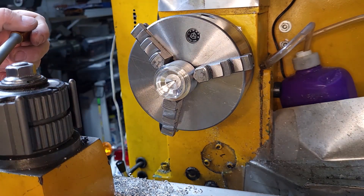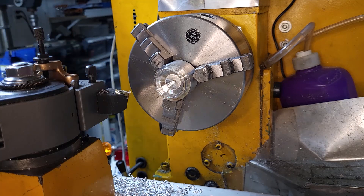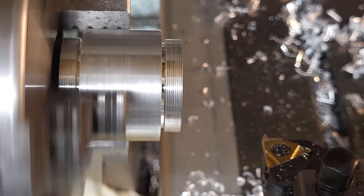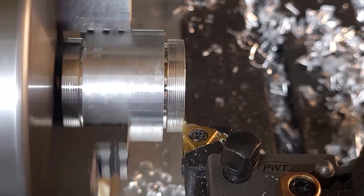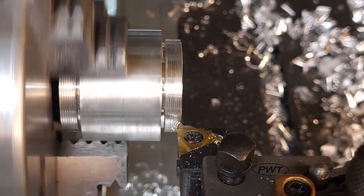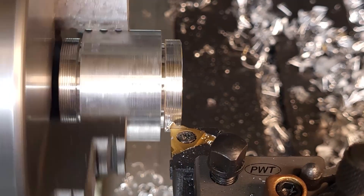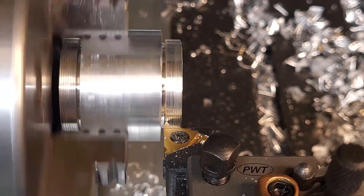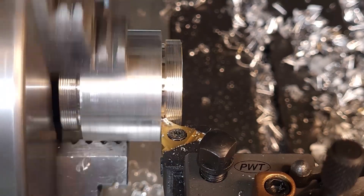Adjusting the speed down to the lowest speed with belt change and fitting the threading tool, then hitting the continue button for the threading operation. The threading operation is a routine I wrote — you just give it the thread size and length and it will do an initial chamfer, then very slowly do the outer diameter of the part. These have been pre-turned to under that size so there's nothing coming off on this pass, and then at the back it will do another little chamfer before getting into the main threading operation.